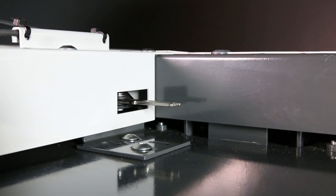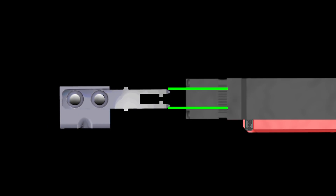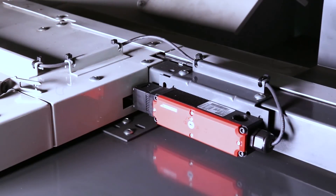Have a look at the alignment between the key on the door and the receiver mounted on the enclosure. If the key is misaligned, the receiver may not see it and give a false indication of the door's status. Align the door by loosening the screws that hold the key on the door or the receiver.